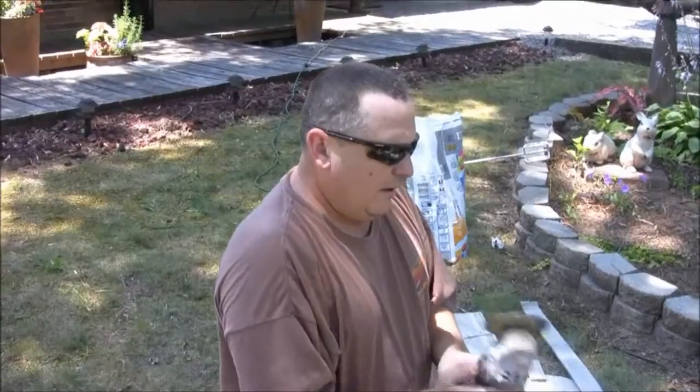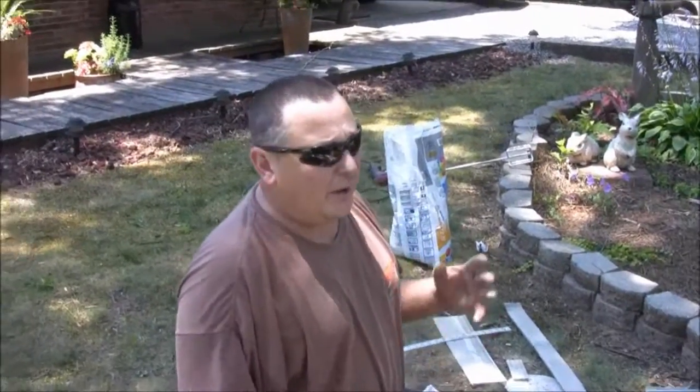I'm going to be putting a piece of tile metal down. Anytime I can, I like to have a factory edge up against the tub to caulk to. So I think that's what I'm going to do this time. It's the same tool I used to cut the Durock with, so I used it to cut the tile a lot of times. Although I have a couple wet saws, they're bulky, you have to have water. Most tile jobs you can do without a wet saw. But if you don't have one of these, it makes it a lot harder.